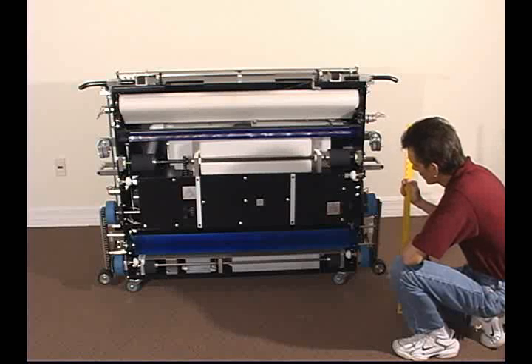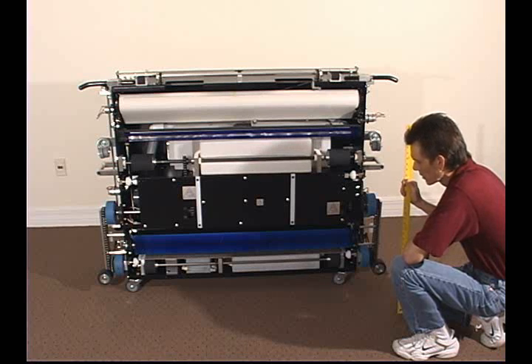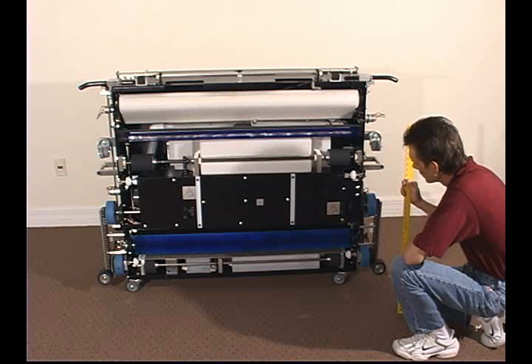In this video, we're going to discuss the buffer brush crush to the lane adjustment. When the machine leaves a factory, we set the contact to 1/8 of an inch. The minimum is 3/32nd and the maximum is 3/16ths. This adjustment is very important to make sure that you have a uniform pattern left to right and that you get good front to back taper.